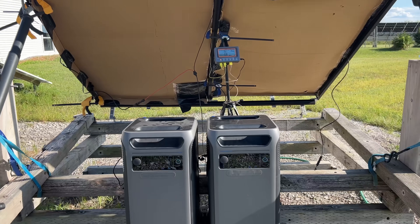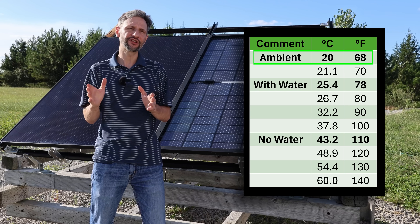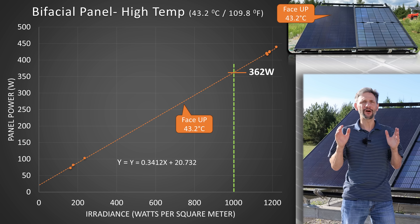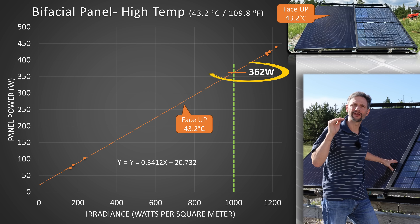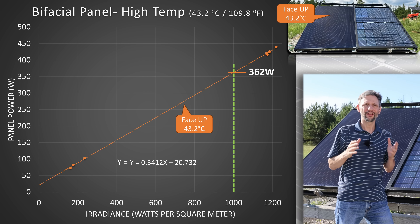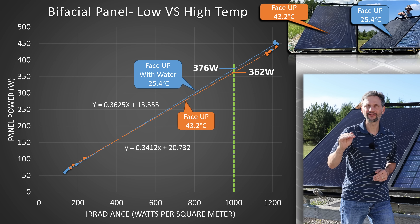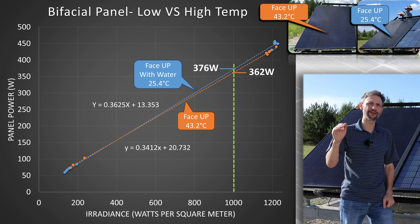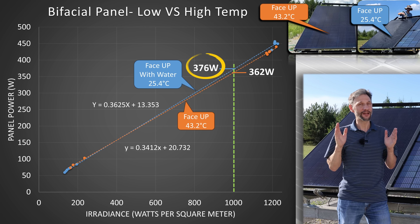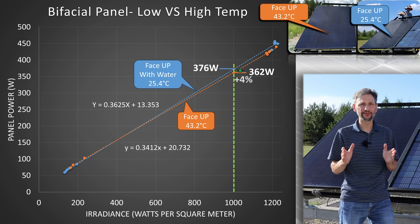Switching to the Anker setup, the results were much more in line with expectations, but not nearly as exciting. Unfortunately, the second test was on a much cooler day. The ambient temperature was 20 C. With the water cooling, I was at 25.4 C, and without cooling, I was at about 43.2 degrees Celsius. The bifacial panel with no blocking and no cooling was achieving 362 watts at 1,000 watts per square meter. The max irradiance was in the 1,200 watt per square meter range, which allowed me to achieve maximum measurements as high as 440 watts. So I added cooling with the hose to drop the temperature to around 25 C, and a much less exciting result — the performance was boosted by about 14 watts. The power at 1,000 watts per square meter was 376 watts, or 94% of the rated output, exactly in line with what I would expect and with what I get with other high performance panels.